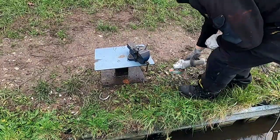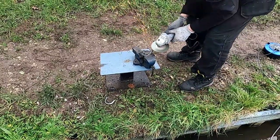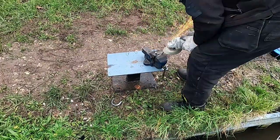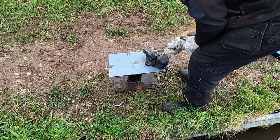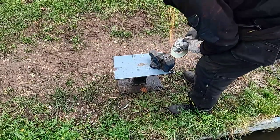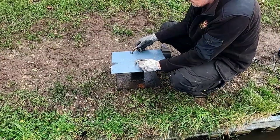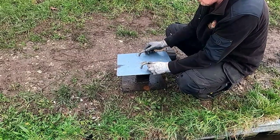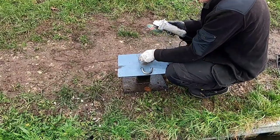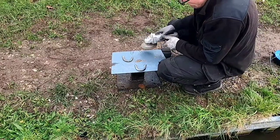I've got my grinder set up and I've got the engine running, running this through the inverter. I'm also running the welder through the inverter — seems to handle it alright. So I'm just grinding the feet of these off flat and putting some edges on them so I can get the welder into the sides and get a nice weld. Just marking it up here and making sure I know where the handles are going to be. I'm going to grind a couple of clean spots so I can weld to clean metal — just grind all the paint off.